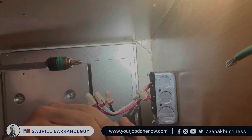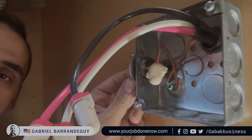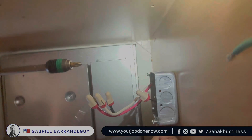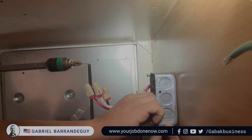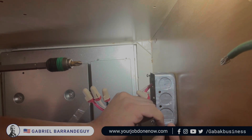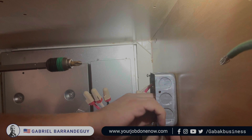I'm going to show you that you have to put the connector inside of the electrical box, and once you do that you are going to be able to run the wire inside. Otherwise it can get damaged. Also, if it gets loose, someone can get shocked. You have to put the nut inside — I'm going to show you closely in another video. Also, the metal box that you see here needs to be grounded as well.